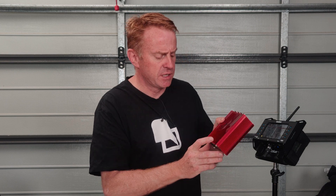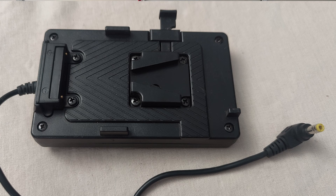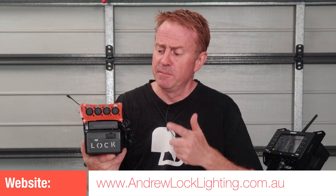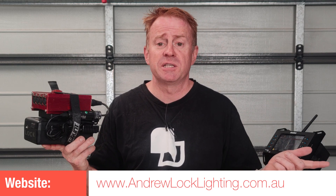This all runs off batteries. The voltage range on this unit is 12 to 24 volts DC, and I happen to have V-mount battery plates that could plug right into it. I looked around online and tried to find a purpose-built solution, but everything seems to be studio-oriented — 19-inch rack mount, built into a power distro system, no battery capability, 12 or 24 outlets, or 3-pin XLR instead of 5-pin XLR. All I really wanted was something small like this — four or five outlets that runs off a battery. I just dump two of these on either side of my set and I'm covered.